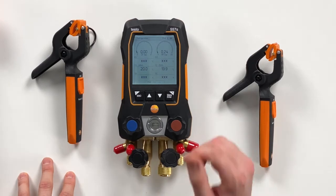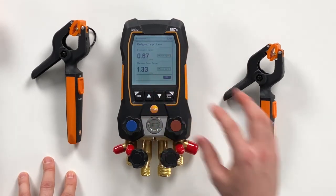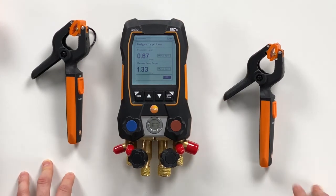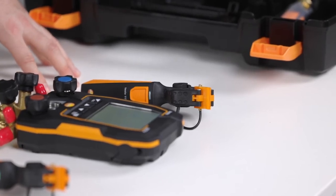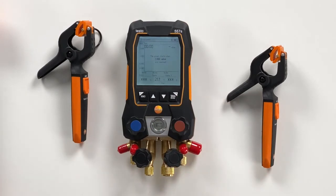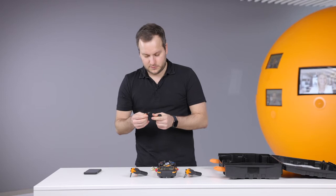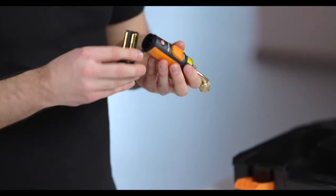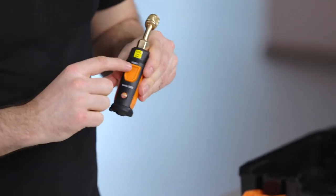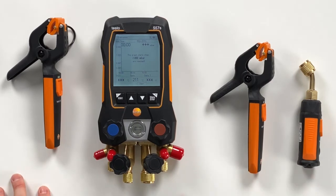We will not measure now, but we will also show the evacuation mode. We navigate through the menu to the evacuation measurement. The new thing on the user interface is that you can configure target lines — how deep you want to pull down the vacuum and what is the maximum decay that is allowed. We confirm this, and then this menu is waiting for the vacuum probe, which we take out of the case. In the vacuum probe you just have to open the probe, then there's the strap in the battery compartment — also remove this — then we put the batteries back in. You can see it's directly connecting, waiting for connection, and now it appears in the display and is waiting for the values to go down to vacuum level. So we would also be ready to start here.